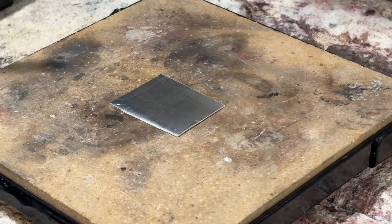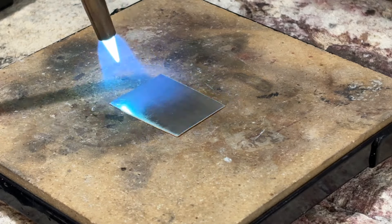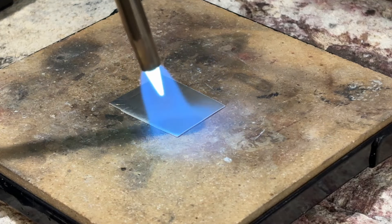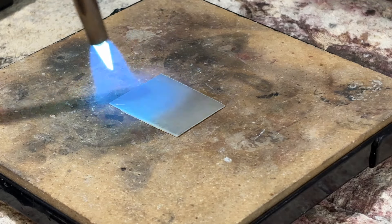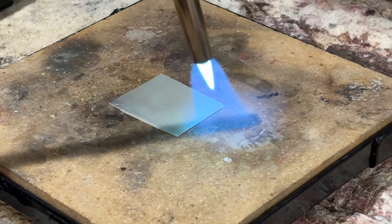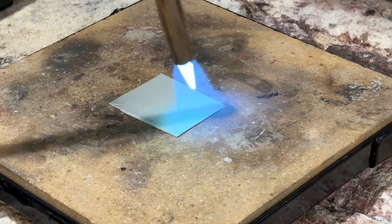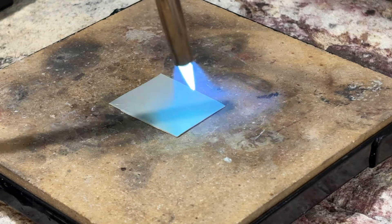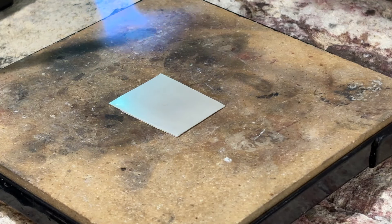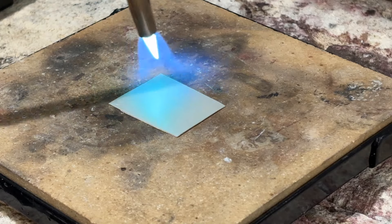After gently brushing it with the brass brush, you want to make sure that your silver piece is completely dry, because some of the minerals can water stain onto the piece and that's going to affect the final finish. What we're going to do is repeat that process of heating it with the torch, pickling it for a minimum of three minutes, then cleaning and neutralizing that pickle, and then going to the sink again — repeating that process a minimum of four to five times or more if necessary. You'll see slowly that that skin is going to develop, and you may see some dark spots indicating where the oxidized copper is that will be removed by the pickle.